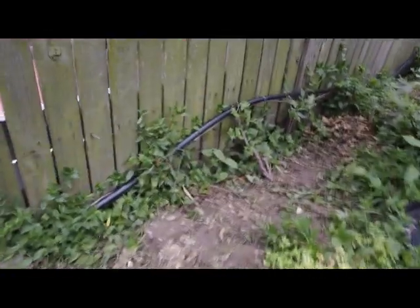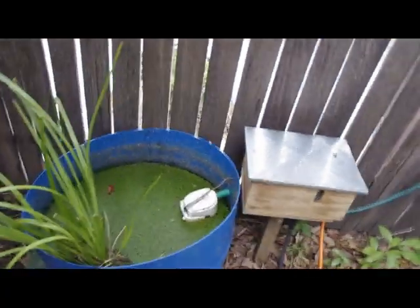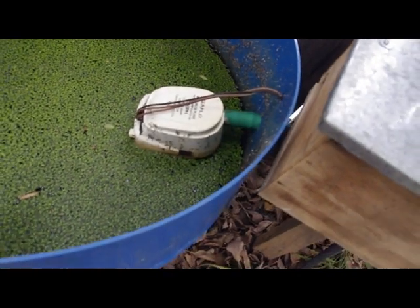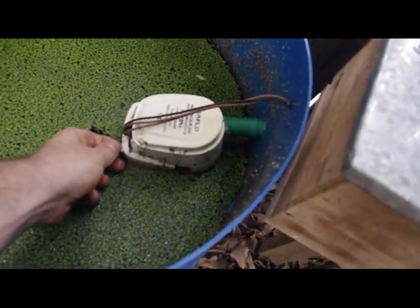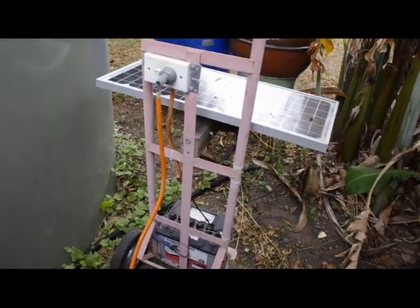It then overflows through a strainer to keep out debris and flows by gravity through black poly pipe to the holding tank along the back. I also built a 10,000-liter tank here. The water ends up by gravity in a little holding area, where there's an automatic float switch bilge pump — Sea Flow brand, 12 volts. When the level comes up the float switch turns on and pumps the water into the tank. I've run this on a small solar system — a trolley converted into a mini power pack — and that little panel is enough to keep the battery charged.